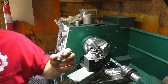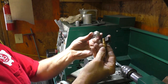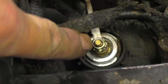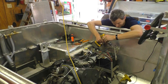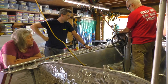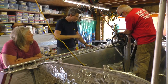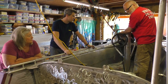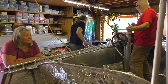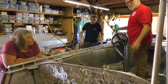This little gadget is an adapter to replace the Volkswagen water temperature sensor, so it will let me fit the off-the-shelf one into there. The moment of truth — touching wood. Fuel on. Oh, the gauges came up. The volts — 12. And the water moved too, so it's working. This would be start, that would be engine off, lights off. I tell you what, that's the first wiring harness I've ever built where everything worked on the first go. High five.